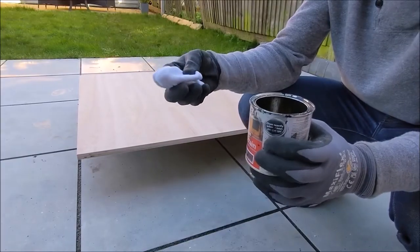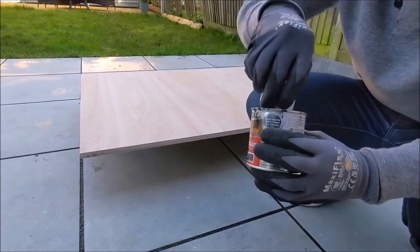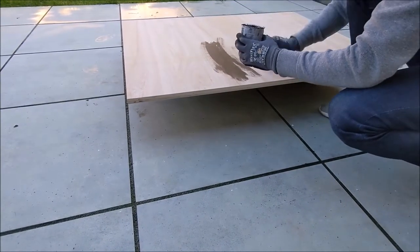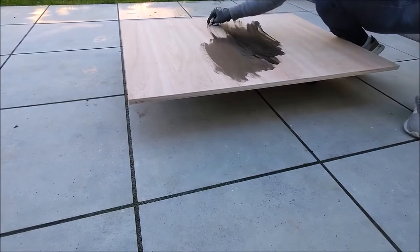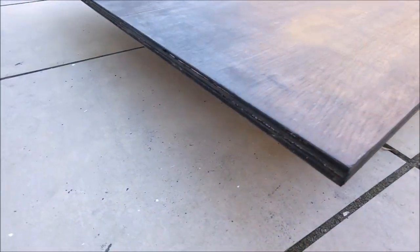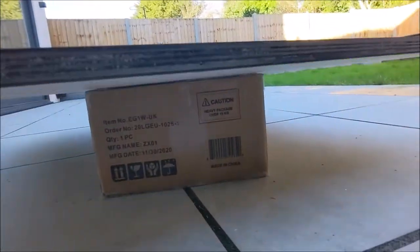To start staining, make sure your surface is dry. Get a piece of cloth, dip it into the wood stain and start rubbing it onto the wood. Stain with the wood grain for a nicer finish. Once you've stained all over your surface, let it dry for 20 to 30 minutes then flip your wood round and stain again. Make sure you don't leave one area darker than the other — try to rub the stain evenly so you have a nice even finish.